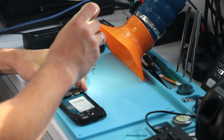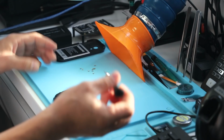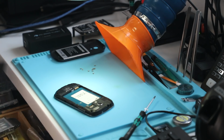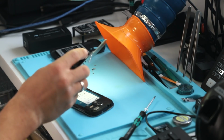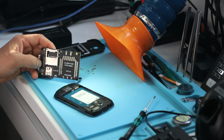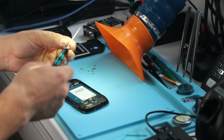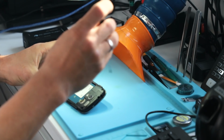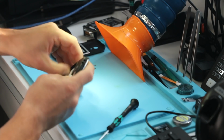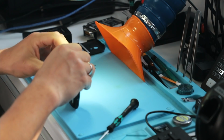but they're still fun to work on, and we'll see if we can get this one. Most of the time, what's used to read those out would be an eMMC adapter such as this. We'll try something different today. We're gonna try PC3000, the breakout board for MMC and protocol, and I think it's gonna be interesting. I'll also be doing this on PC3000 at least for the first time, so I want to see how that works. So I gotta get this frame off of there.